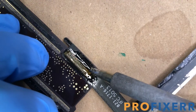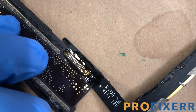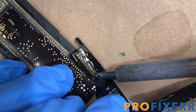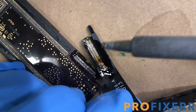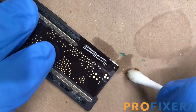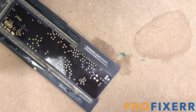And so you see here, it's already loose. On camera it's kind of hard to position my hand so I wasn't bumping into the end of the camera. But go ahead and grab it, and you'll have to hold the motherboard down with one hand as you kind of pull up with the other, because the flex cable is still glued down. It's got some really gummy adhesive holding it onto the motherboard. Just using isopropyl alcohol, it pulls that adhesive right off, and it also cleans up all your old flux.